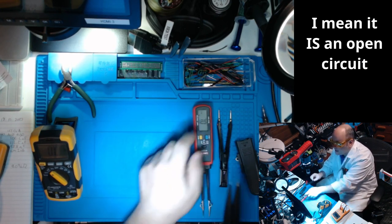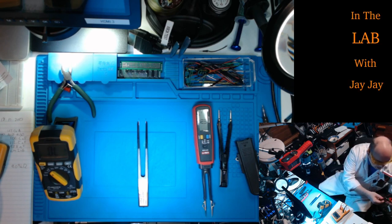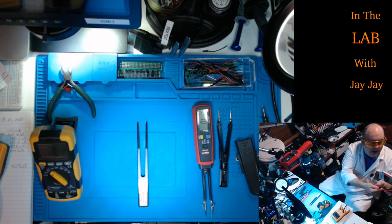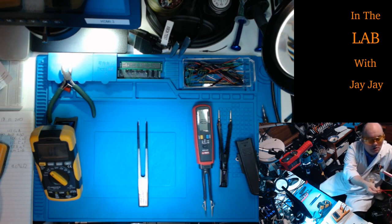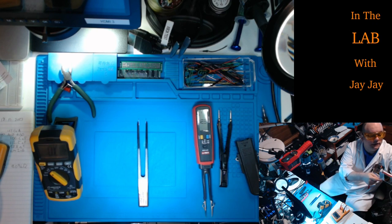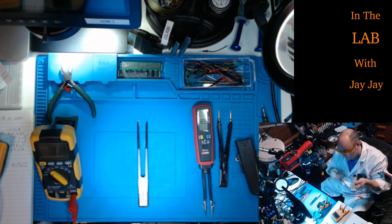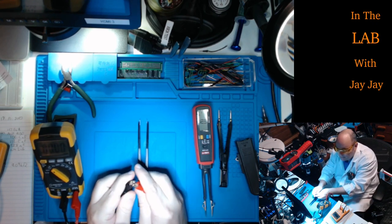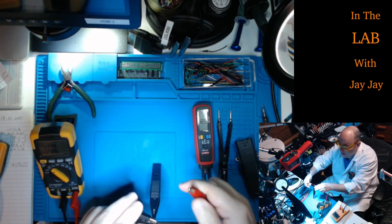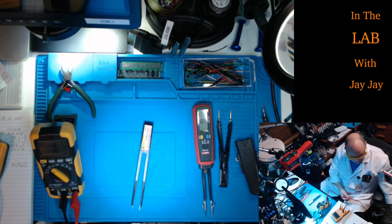So it's not showing a reading. Let's try with alligator clips and see if we can get a reading that way. We'll put him on positive and negative, put him in ohms mode and check that's zero - it is. Now let's do the final reading across the thing. It's open circuit, so obviously it doesn't engage the resistor until it's detected a voltage.